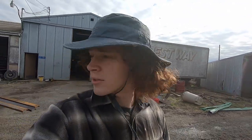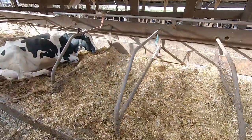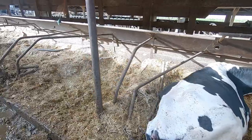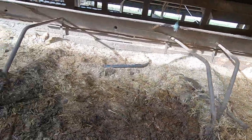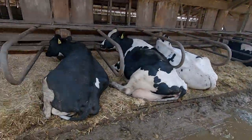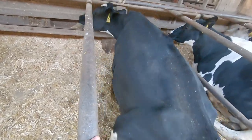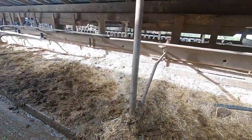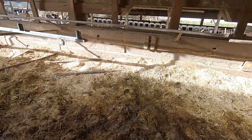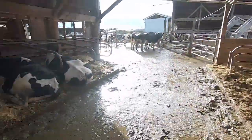Here's the difference: this side of stalls is all the old stall stuff we're taking out — it was installed in like the 60s or 70s and it's just not good. They're too rigid because cows are big animals, they get up and move around a lot. The loop stalls have some wiggle room, so if the cows bump into them they don't snap. The old ones are solid into the ground and if they get any pressure up against them they just break. So they're coming out — we're going all loops on both sides.